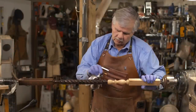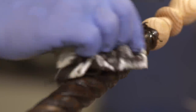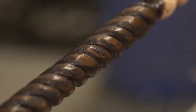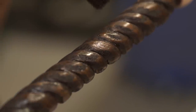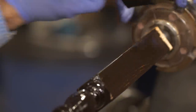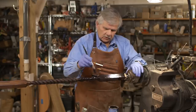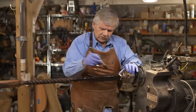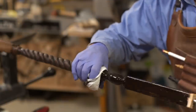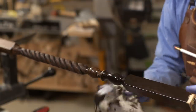Because I used a rasp on the rope detail, you can actually see how it's rougher looking — and that's what I'm looking for. If you ever look at a piece of rope, like jute, it's got a little texture to it. It's always tricky when you're trying to match stains — it could be the same species of wood but still stain differently. I'm wiping it off very lightly; I still want it to lay on there and dry.